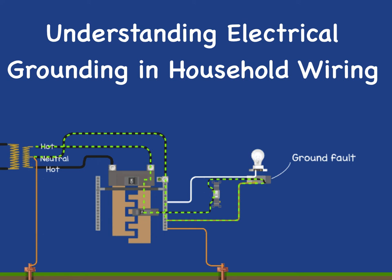In your home's wiring system, the power is normally carried by the hot wires to the load, while the neutral wires provide a return path to the source after the load. Both sets of wires enter your home through the utility's main service wires, running through your electrical service panel, and run side-by-side through every circuit in your home. Should some breakdown of the pathway occur, the power may instead flow through other materials, such as metal framing, metal pipes, or conducting but flammable materials in your home. This is what may happen in a short circuit situation, where most electrical fires and shocks originate.